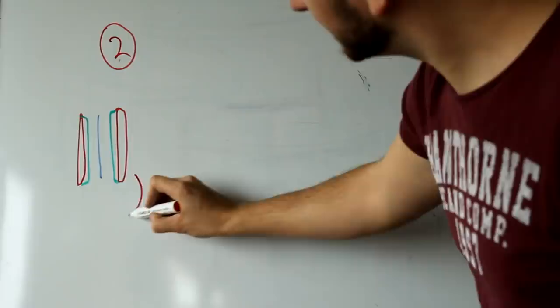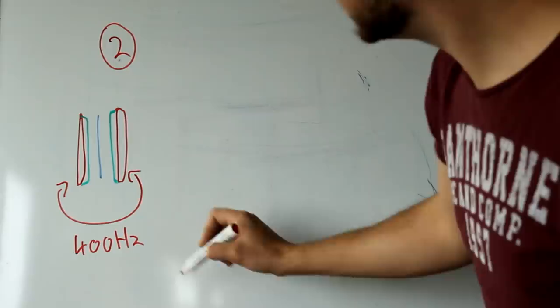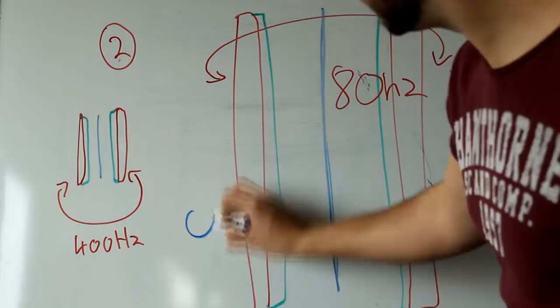As mentioned before, low frequency response is often lacking with electrostatics due to cancellation of the front and rear waves. So if you want to truly build a full range electrostatic speaker, the panel needs to be large enough that the lowest frequency you want to hear can't wrap around and cancel when you're in the sweet spot. Demands for strong deep bass are quite high these days, so the required size for this is often inconveniently large.